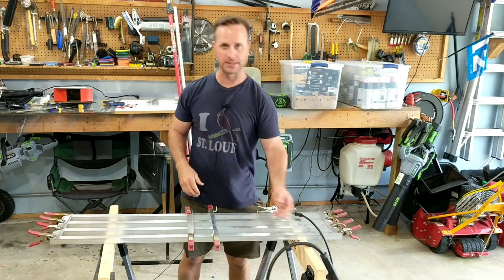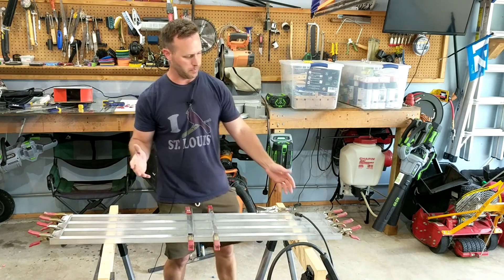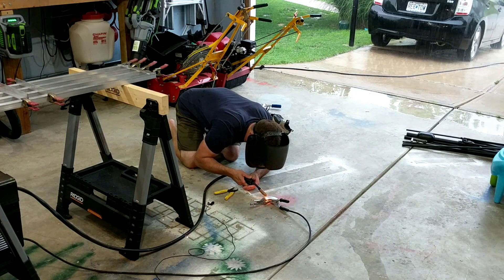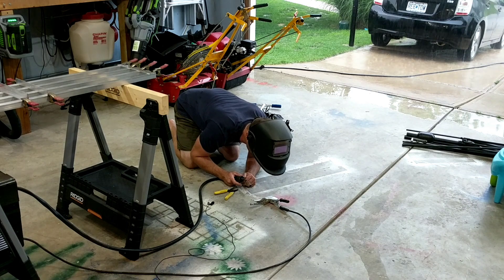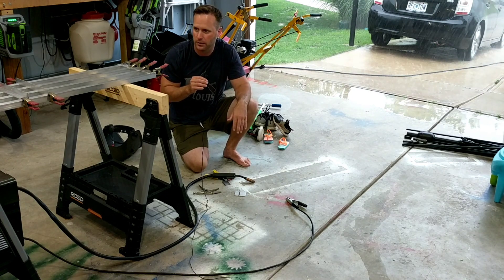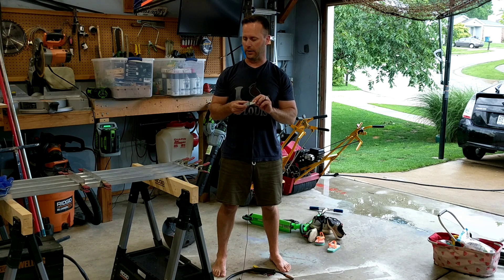So it's been a while since I welded, and the last time I welded was this monstrosity. If I could only show you these welds — they're pristine. Being aluminum is a whole other story, which I've never tried. I've got some scrap pieces I'm going to do a test weld on. That's not good. Alright, so that clearly didn't work — no idea why. Maybe I need to clean it, maybe it has some type of coating on it. Turns out, you need aluminum spool in your MIG welder to weld aluminum pieces together — didn't consider that there's steel in my MIG welder.